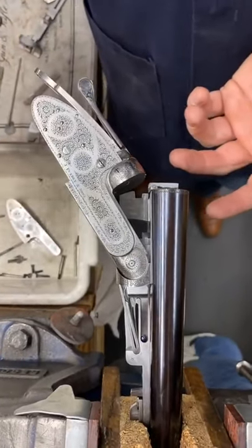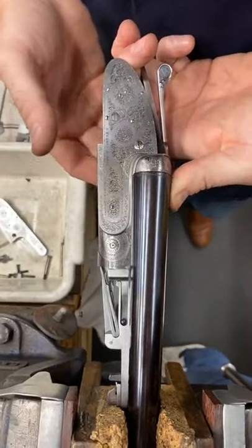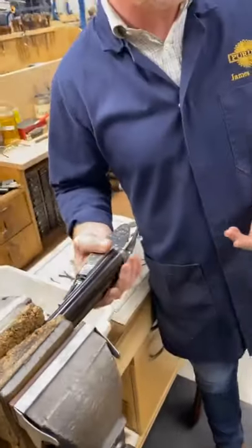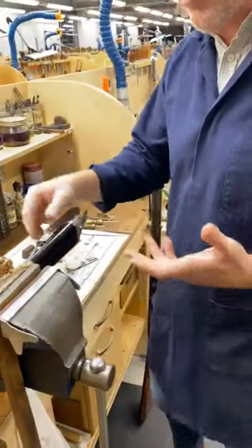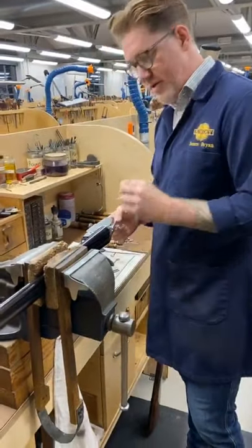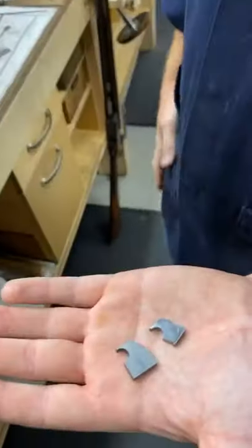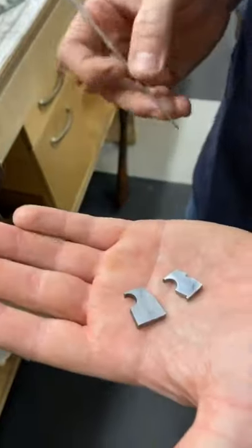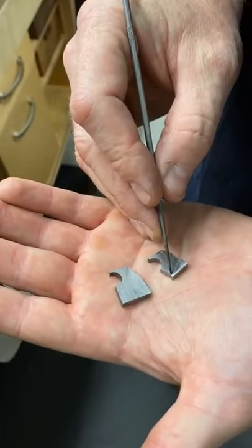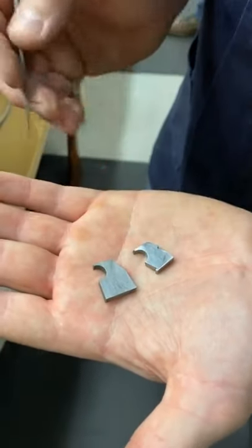So yeah, that's what the ejectors do, and that's how they work. We can go on briefly to the cocking. Most of it we spoke about in the finishing side of things with the regulating, but we have this, a front lifter, which is made like that, and this is what we build as an ejector man. We build this up so it can then be regulated finally by the finishers, but that's another regulating point. And that pivots around the crosspin of the action.